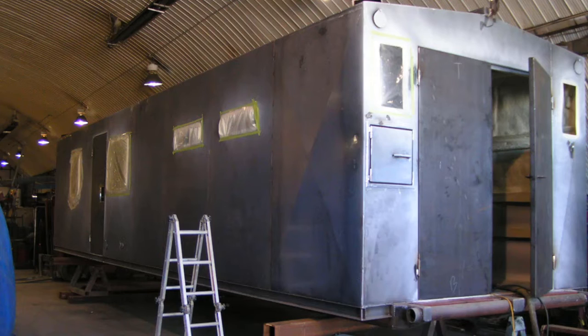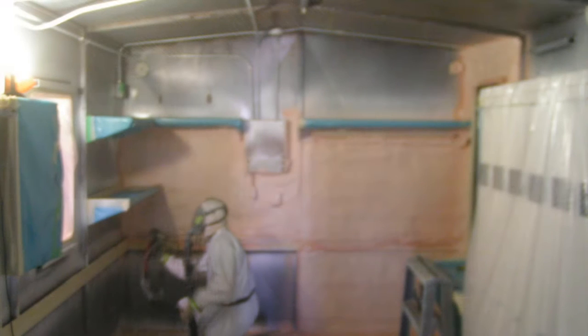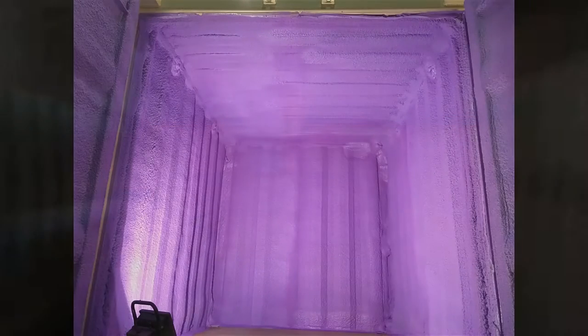Go back to that video I have on how much foam do I need and check that out. Also, if you're going to be dealing with a local building code, you're going to need to have feedback as to what the law is in your area. 3 or 4 inches might be sufficient to satisfy the code officials. If this was in my backyard, I'd be speccing out probably 3, absolutely no more than 4 inches of closed cell foam to the inside of the metal, and then you'd kiss your water problems goodbye. As far as moisture retaining — no. The whole idea of spray foam is there is no moisture retained. The metal can get as cold as it wants; as long as it's fully bonded, it's going to be sealed and you're not going to have any moisture problems between the foam and the metal the way you would with the panelized product. The panelized product is not going to follow the profile, you're going to have seams, and you would guarantee some water and condensation build-up behind the panels at some point.